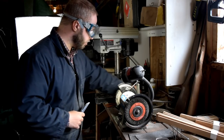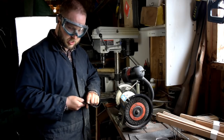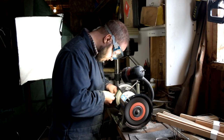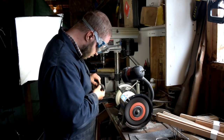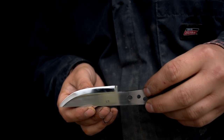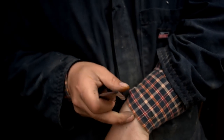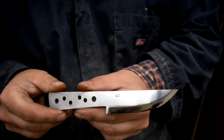Now I'm going to use a felt wheel here. This one's not getting a mirror polish — only up to 800 on the flats, and then 600 on the belt for the bevels. So we'll give them a little buff, and this will put pretty much a final edge on the knife. If I've done a good job up to here, everything is super easy after this point — easy for my skill set anyways. You can see those bevels look absolutely beautiful with the polish there. It is razor sharp, shaving sharp — easily just wipe the hairs right off my arm.